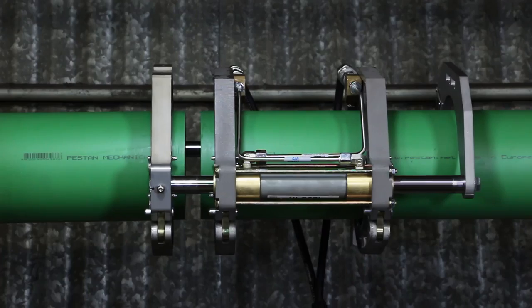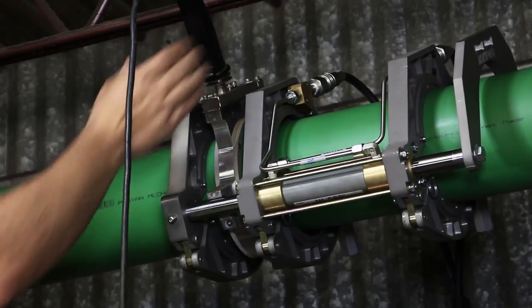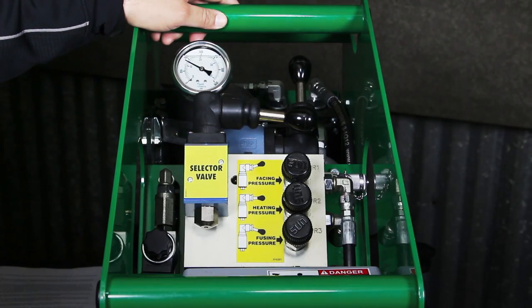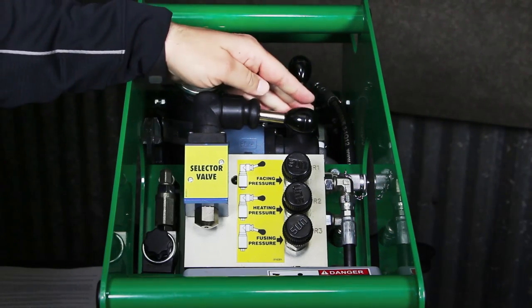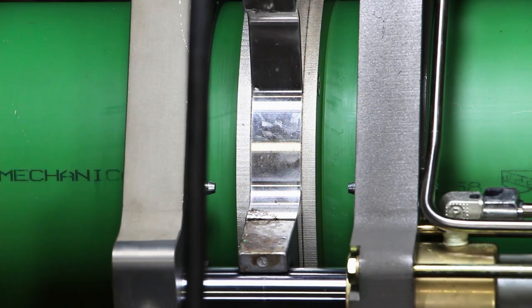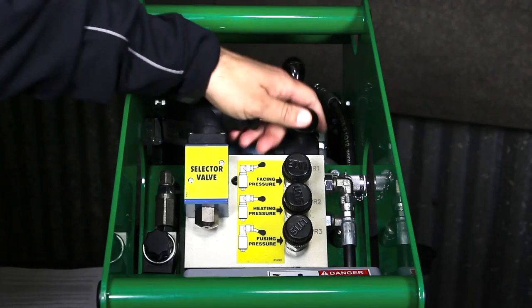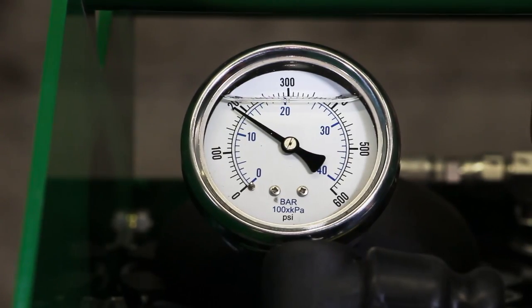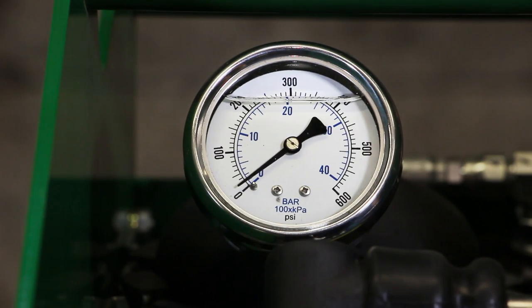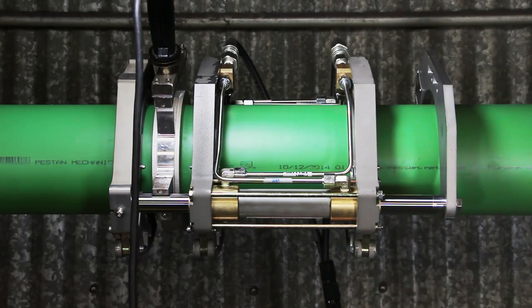With the heater clean and up to temperature, open the carriage just enough that the heater can fit between the pipe ends, then place it in the carriage using the guide rod brackets. With fusion pressure set and slippage checked, close the carriage so the pipe ends come against the heater and wait for the appropriate bead to form — McCalc specified a 1mm bead (roughly 1/16 of an inch) for this pipe size and DR. Once the specified bead height is reached, shift the pressure selector valve to the heating position, watch the gauge or data logger to confirm pressure has dropped to drag, then shift the carriage control valve to neutral to relax the carriage and ensure no pressure is trapped in the cylinders during heat soak.